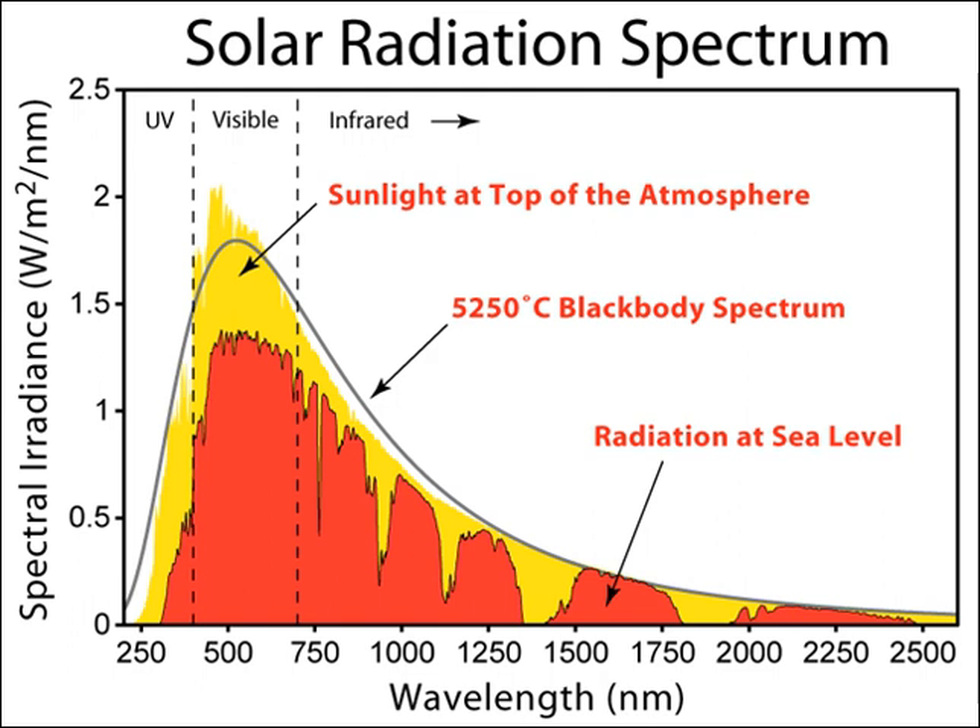After the proof of concept was completed, laboratory scale silicon wafers were fabricated using standard semiconductor integrated circuit fabrication techniques. E-beam lithography was used to fabricate the arrays of loop antenna metallic structures. The optical antenna consists of three main parts: the ground plane, the optical resonance cavity, and the antenna. The antenna absorbs the electromagnetic wave, the ground plane acts to reflect the light back towards the antenna, and the optical resonance cavity bends and concentrates the light back towards the antenna via the ground plane. This work did not include production of the diode.